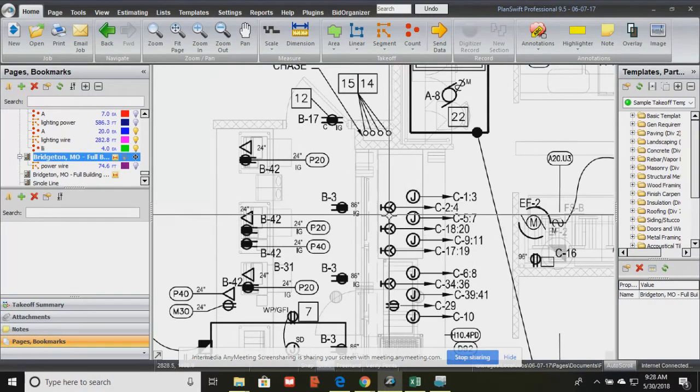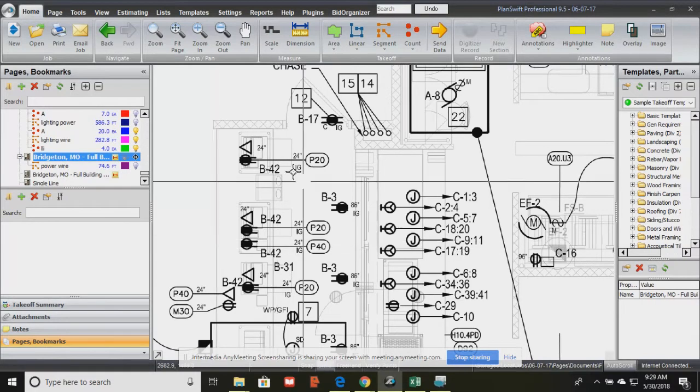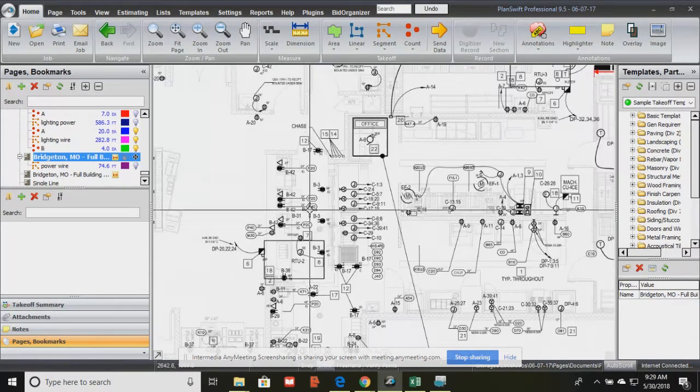Okay, so you see the different outlets. That's a specialty outlet, the ones that look like the little Ys, okay? And that's a different kind, integrated ground. So there are so many different powering devices. But all this is telling the electrician is each of these outlets will be in a specific physical location, and that is telling the electrician what panel, right, and which position on the panel that those wires need to be connected to. That's all we're looking at.